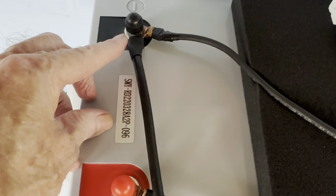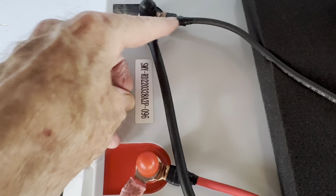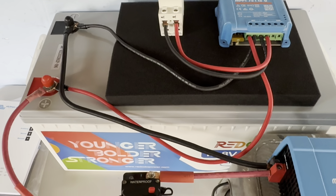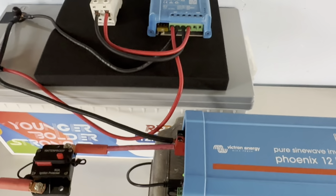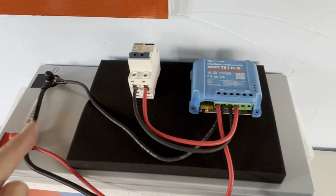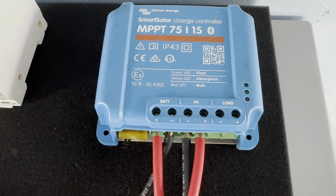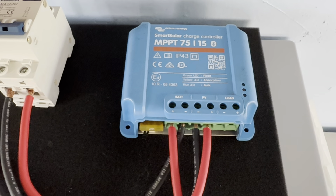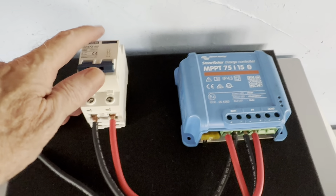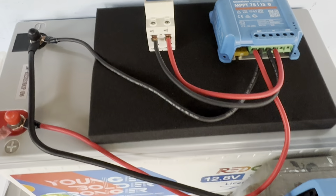There's enough room on these M8 terminals to stack up a couple of leads — I've got the charge controller and the inverter both coming in there, which is really nice. I measured everything and gave myself plenty of room. The system is up and running, the charge controller is on, the app showed us the battery voltage, and the last thing to do is tie in the solar panels and flip it on — but I'll wait until I move this into its permanent position.